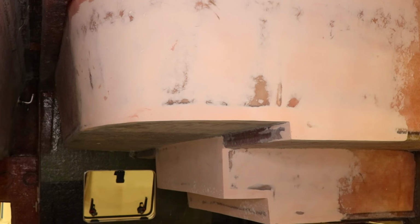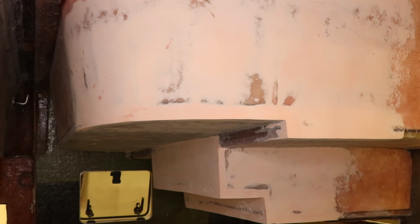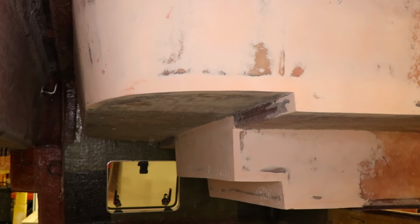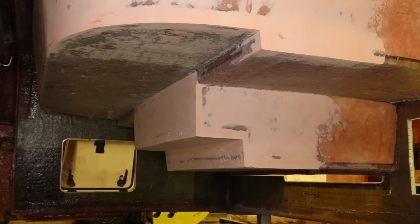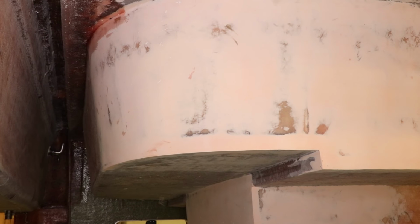Another thing you can see here, this area is going to get wrapped with a foam back vinyl and bonded in place. And you can see the guys have gone through and sanded it, then troweled through a filler and over sanded that, so that when we put the foam back vinyl on, we get this beautiful smooth surface. That beautiful surface on the outside means that inside we've done the work to make it flat and true. So many details in an Aspen.